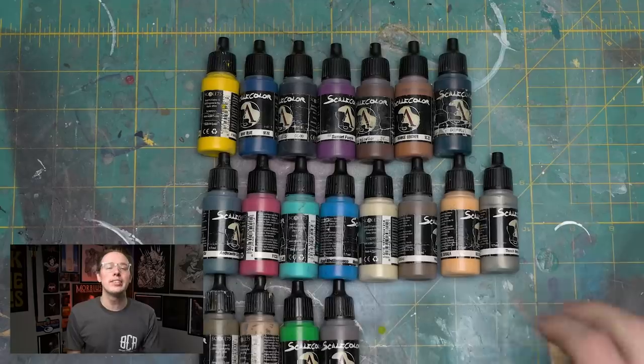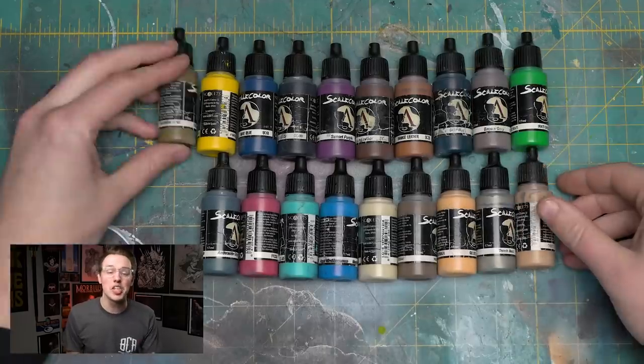Poplar, unlike my last carpentry project, is a lot softer and easier to shape. It also takes paint really well, which would be great because we're gonna be painting this case later. I learned from my previous mistakes on this project in that I sourced my material and the dimensions of my material before designing the project so I can design around what I have, which makes it easier for me in my somewhat limited workshop.